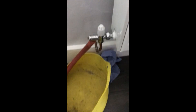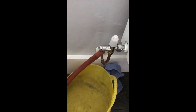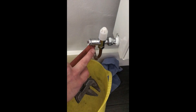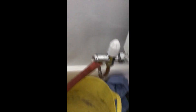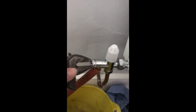So now we've located a drain off valve at the ground floor at the lowest point. We've connected our hose up. We've put a little tub underneath with a bit of blue roll just to mop up any bits of water. Sometimes this seal here isn't the tightest and a little bit of water can seep out. It's rare but it's always best to prepare. So you put your spanner on the end there and simply open them up.